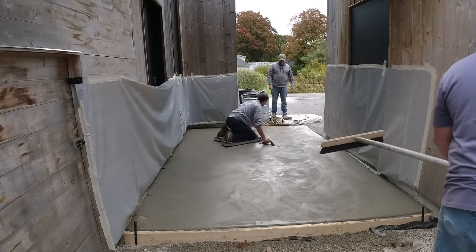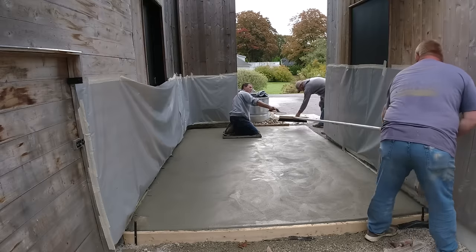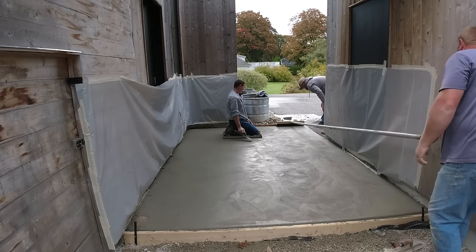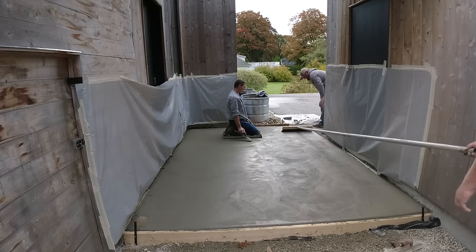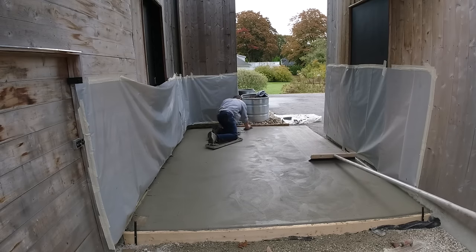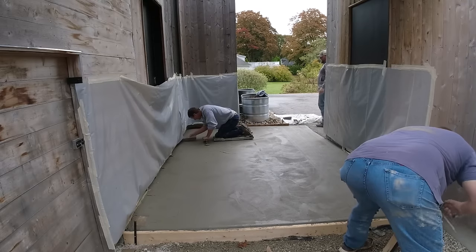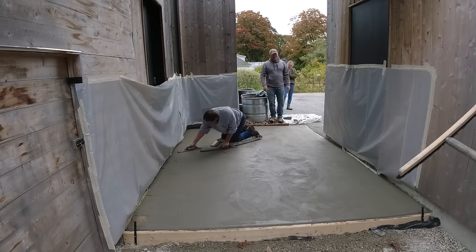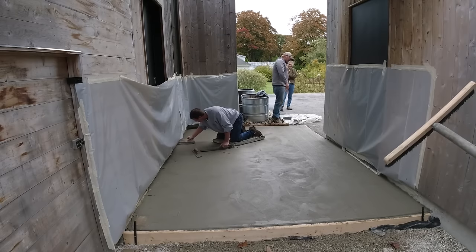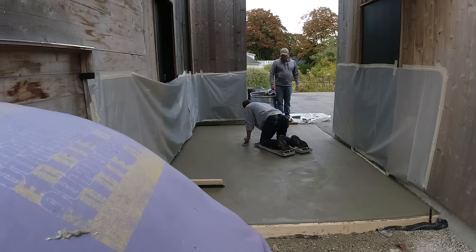You can see how much tighter it is now — everything's really firmed up, no paste left over after I mag. In states where you don't get freeze and thaw and don't use air entrainment, this is where you'd be steel troweling the surface really smooth before pulling the broom over it. Here in Maine, magging it twice works better in the long run — we don't see any surface damage. Having the heat in there should help too; they're going to warm the slab up to melt snow and ice so they don't ever have to use de-icing salts.